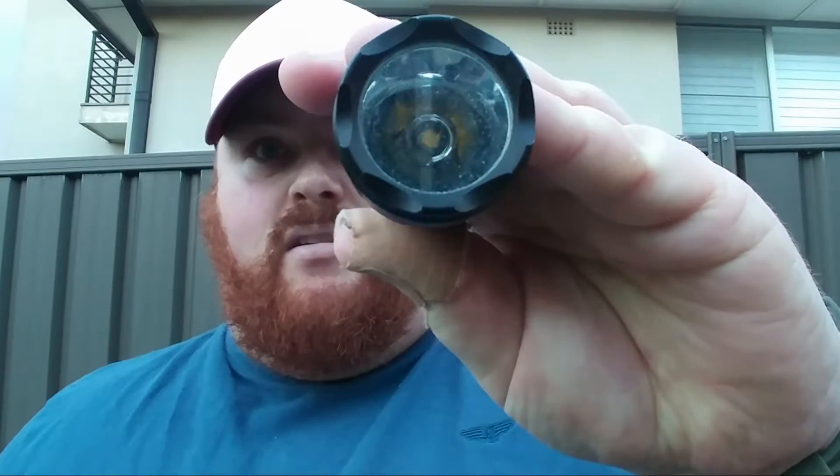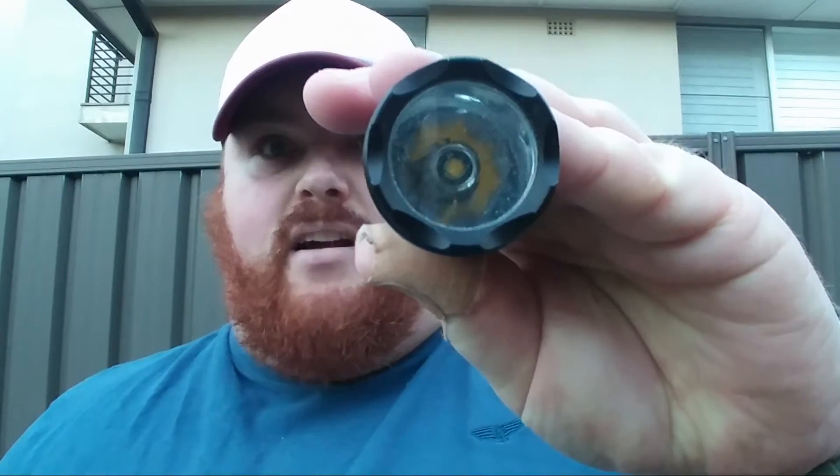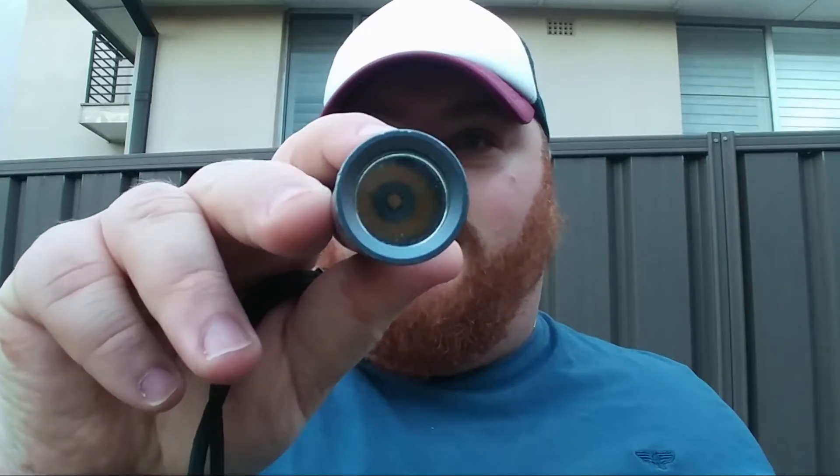It's hard to expect more lumens since it's an older LED — a T4 style, similar to the original XMLs. It's got no AR-coated glass, unlike the Nichia which does have AR-coated glass, so I'm not sure if that affects the tint. It could be a Z5 or a 5D, but it's definitely a T4 — and T4s are 80 plus CRI from what I could tell.